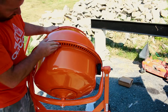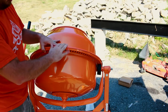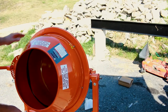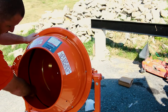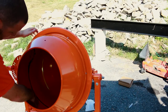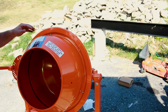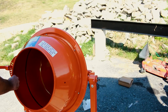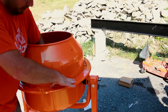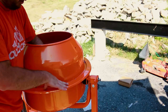Put a nut on one of the sides and one on the opposite side just to hold the lid in place. On the inside, you can see where some of the grommet is not set right, so just push that down into place and get it flush with the top and lower drum. Once you have that close, go ahead and start cinching up your bolts underneath. As you cinch, reach inside and line up that grommet to make sure it snugs down evenly.